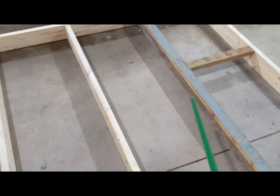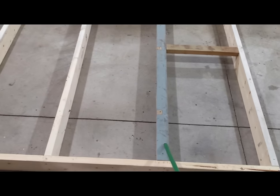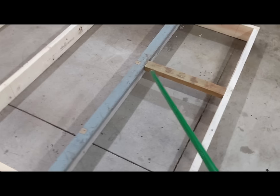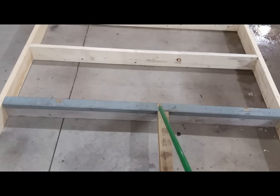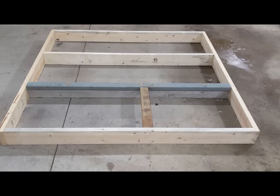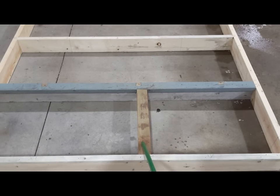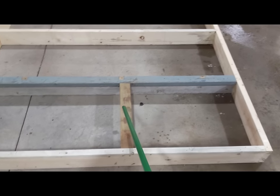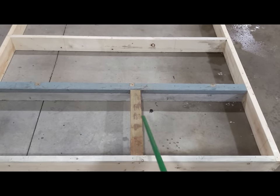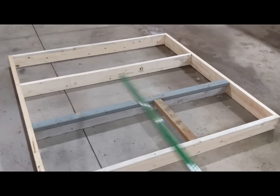On the third joist, rather than just use a regular joist — which you can do and seam plywood on — since plywood is four feet wide, I'd like to have a little bit wider board here so I have room to screw both seams of the plywood down on each side. It's about a four-inch tall piece under there with a three-inch one on its side so it's flush on the top. I'll have a plywood seam coming right down the middle. I used treated three-quarter inch plywood for the floor — that makes a real nice, solid floor. You'll need two pieces to build this.